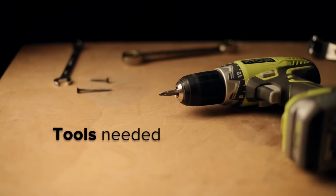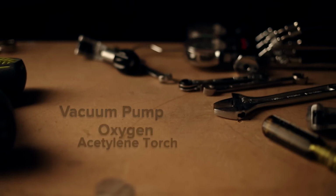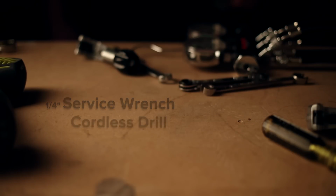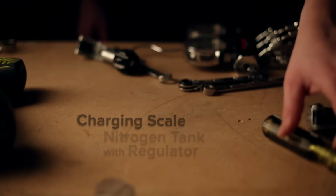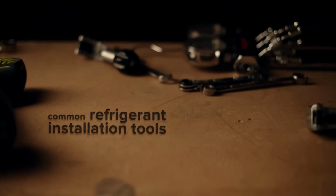The tools needed are a vacuum pump, oxygen acetylene torch, 1/4 inch service wrench, cordless drill, micron gauge, manifold gauge set approved for 134A, charging scale, nitrogen tank with regulator, and other common refrigeration tools.